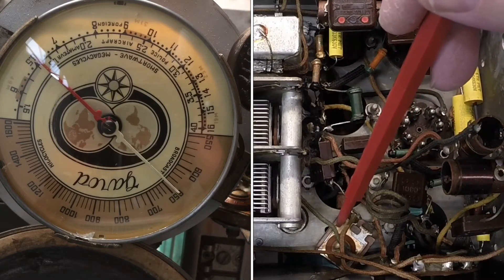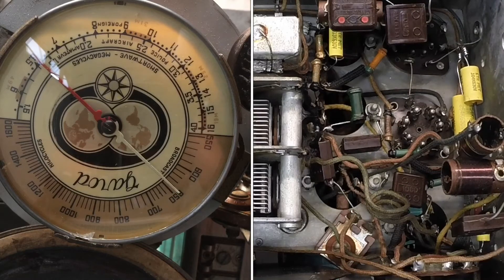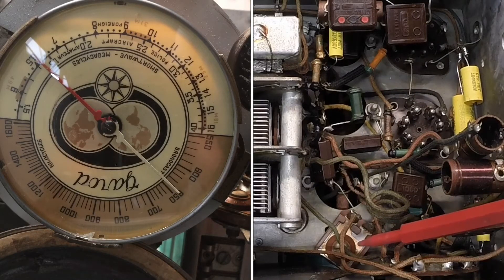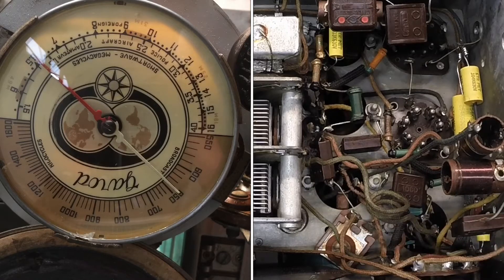This is my 600 kilocycle padder. I think there's a problem with it as well — seems to be a lot of sensitivity around that, so I think part of my problem is two-fold: the padder itself, and I'll probably end up having to take it out and just check it out, maybe do some cleaning there underneath the plate, figure out what's going on there.